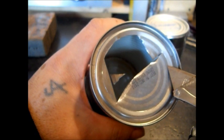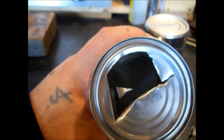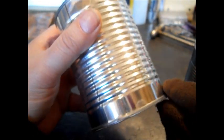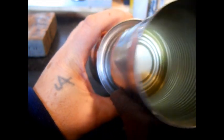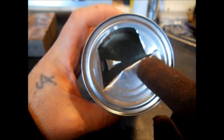Spend more time than I did. I did score it up. These are pretty tough cans, but some cans are softer. The better you score this line, the easier to break, because you're cutting like halfway through the tin. We'll be back when we're ready to form that lip with this can. These soup cans work really well for doing that. Using a can like this, the old style — I made another video and it turned out very good. This will be a smaller burn chamber. The cranberry can is a smaller diameter, but I want more air space. This is a defective dented can — I will try to get that dent out too. We'll be back once we get this all done to show how we roll it in there.